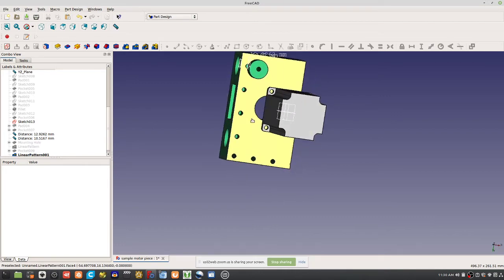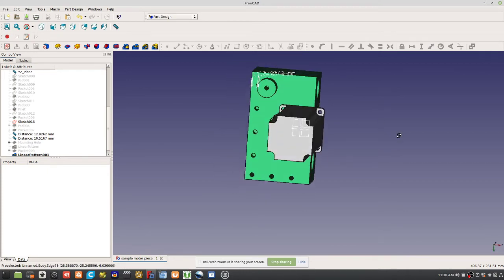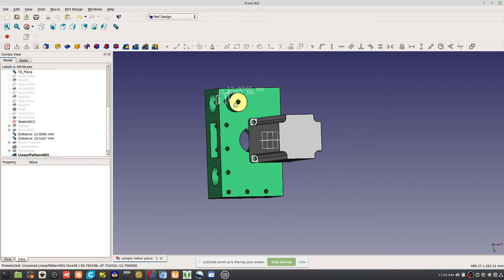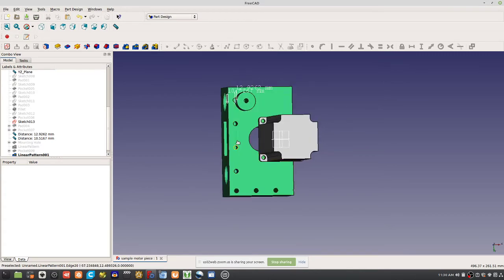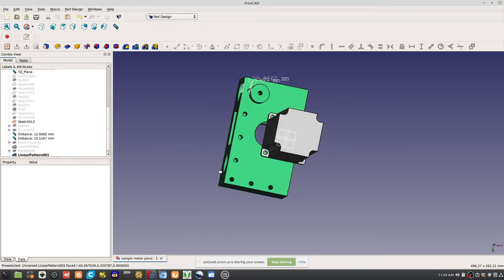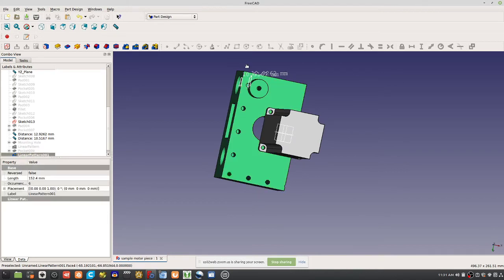Now what happens if you could take another piece, so a piece like this, you can now attach something at a right angle to it. If you had another piece like this, you can attach it on its face, you can attach it to this other face. Now the main thing we worry about here is, of course that hole there is bad because it would go through the metal, so that wouldn't work. This hole wouldn't work either. But this hole here, and maybe the one above that one, would be good mounting bolt holes.